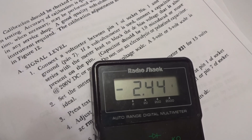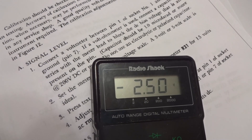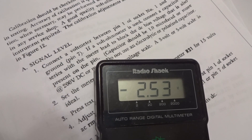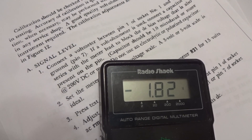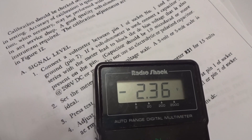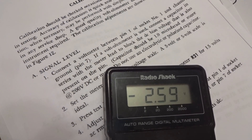I have test one pressed down, and we're getting a little fluctuation there as I move this. Just to show you, if I turn this all the way counterclockwise, you can see you're at 3.5, and then if we go all the way clockwise, we can bring it down to 1.8, 1.9. We're looking for 2.5 volts DC. And that's about as good as we're going to get it. Now you do know that's negative 2.5 — so that's normal. Negative is normal on that.